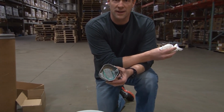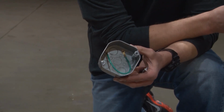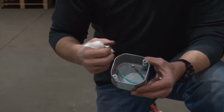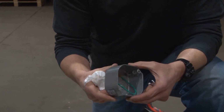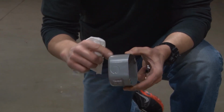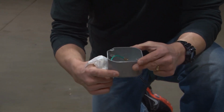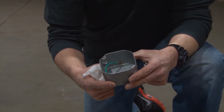Garvin Industries now manufactures a weatherproof ceiling fan box for heavy fixtures or ceiling fans that are installed outdoors in gazebos, porches, or other outdoor living areas. This particular box has completely sealed knockouts that are flush with the surface of the box and a heavy powder-coated finish that creates a weather-tight or vapor-tight seal.